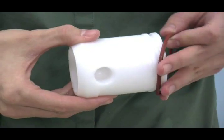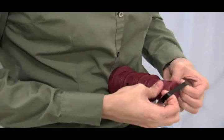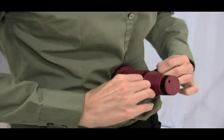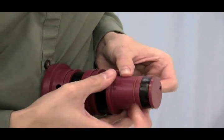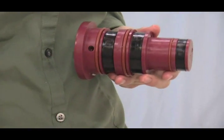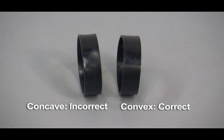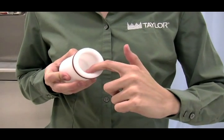Air mix pump assembly: slide the o-ring into the groove on the piston. Do not lubricate this o-ring. Slide the three check bands and three o-rings into the grooves on the liquid valve body. Do not lubricate the check bands or o-rings. Check bands have two smooth surfaces. A concave shape indicates an incorrect assembly. Turn the check band inside out to correctly expose the flat surface.